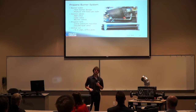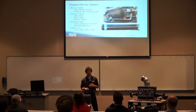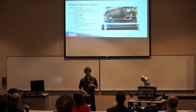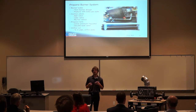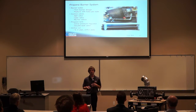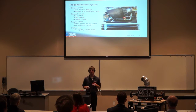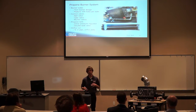Our propane burner system had a twin burner design using 20-inch 3/4-inch tubes, each with 104 holes drilled at 30-degree angles to push heat upward. We had four control valves: a ball valve, a gate valve, and two burner valves. The ball valve was threaded on while the gate valve and burner valves were welded to prevent leaking. Our propane tank had an inline pressure regulator and a double-seat valve. The orifice run was fabricated from two 3/4-inch pipes and an orifice plate.